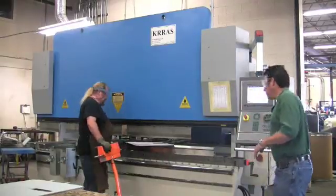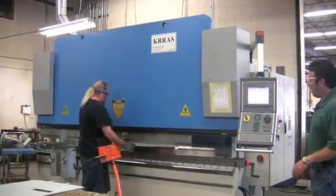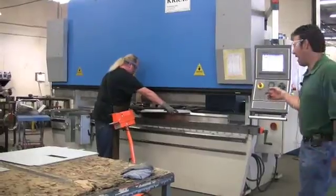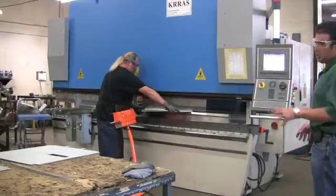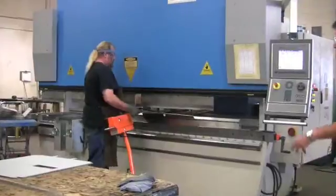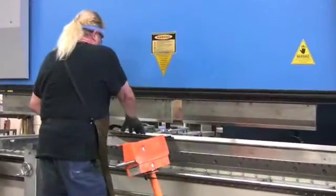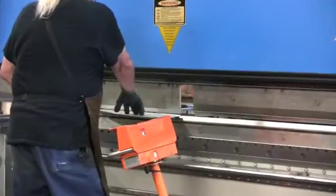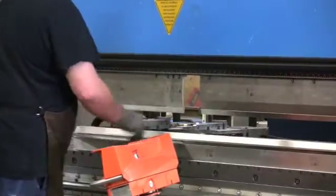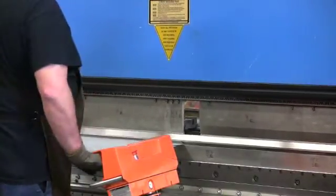Right now we're doing a very light crosshatch to strengthen the part — Dan will hit it both ways. The tooling in the press brake is a Dutch hemming die, so we're doing everything you see here with that die. The machine has to be extremely precise to do all these bends. The die comes down, the bottom die goes down, and tonnage is applied to make the bend. Now we do our hem, and the back gauge gets out of the way — that's flattening the hem.